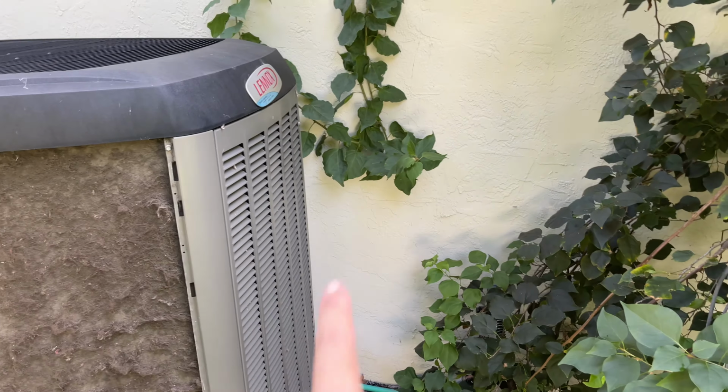Looks like doing it from the outside actually works a lot better than spraying from inside, because for my application, the inside is very clean. There really isn't much anything to do. The outside is actually preventing the inside foam from coming out. So doing it directly from the outside actually helped quite a lot in removing most of the gunk. And I'm suspecting I might have to apply a few more rounds of the foam coil cleaner, but at least at this moment, I think the machine can breathe at least 50 to 60% better compared to when it was fully clogged, okay?